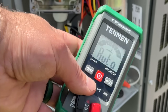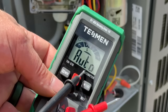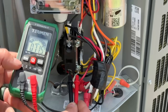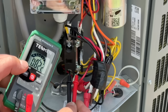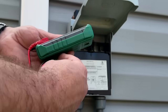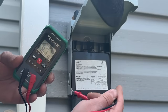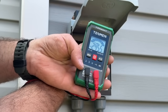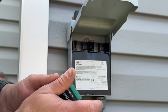We have our Testman multimeter here — this is an awesome little tool that's super cheap and really versatile. It auto-detects, so we're just going to put our leads one on each terminal and verify that this reads zero. And a good thing to also do is verify that this meter is working correctly. Our two line terminals are going to be these outside ones, and when we put our meter there we get 245 volts — so we've verified the voltmeter works and that we don't have power at our unit.